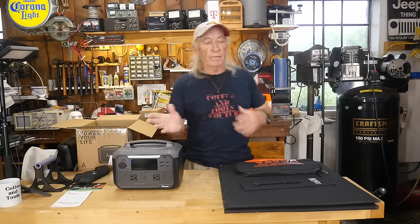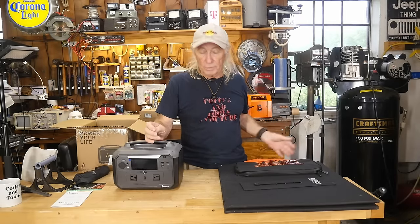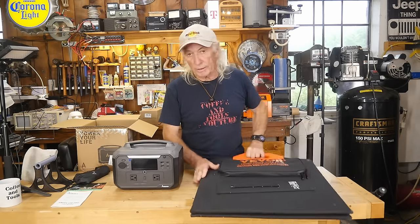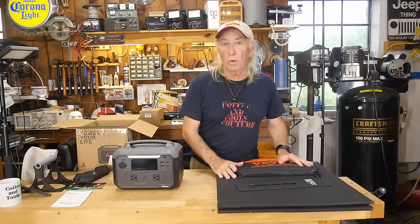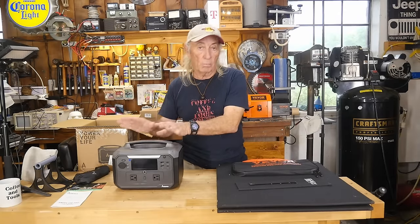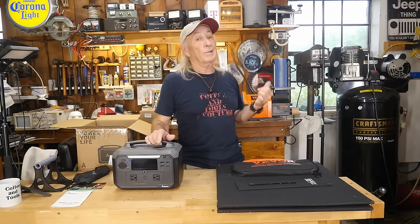I picked something. I've got different portable solar panels, anywhere from 100 to 400 watt systems. This is a 200 watter. Well, this one here is by Vivor, and I just checked it, and it's 18 to 22 volt. So it's perfectly within the range of 12 to 30 volts, so we won't burn or damage this thing charging it. Now, it is not sunny out, but it's very gray, very overcast.